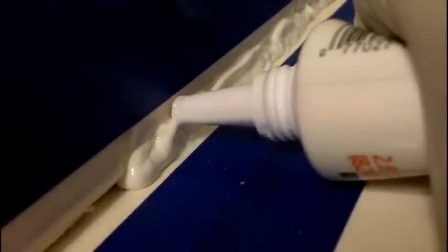Now I'm going to show you how to lay down the tape properly. You want to run your finger across the edge of the tape to make certain it's secure and that no caulking bleeds through, because when you start to pull the tape you want a nice clean line. Now it's time to demonstrate the tube type — just the caulking that you squirt in. What you want to do is lay down a generous bead. There's a little gap underneath the tile, so you want to make certain you put enough in to fill the gap. Don't worry that it's not smooth, because we're going to come back over it.